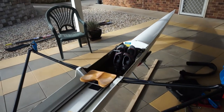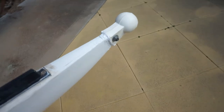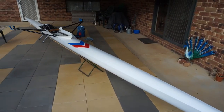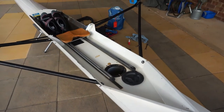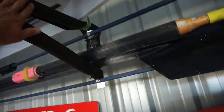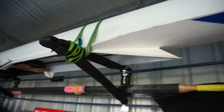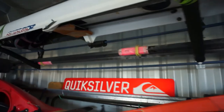It's almost ready to go - the last thing is to fix up the oars, which will be another day. I put a bit of silicone around the bow ball area to seal it and stop water getting in. The boat is looking like a rowing system now with insulation on the rack from the previous video. It sits on foam with straps around it and the oars tuck away underneath. All I've got to do now is varnish the oars, replace the hand grips, and replace the sleeve and buttons.